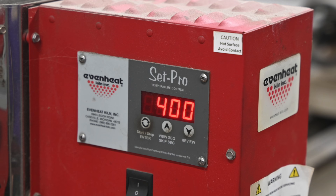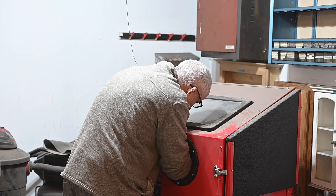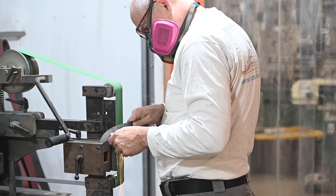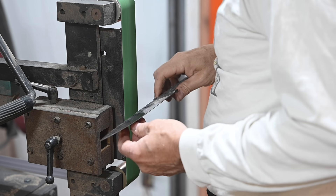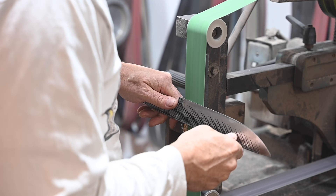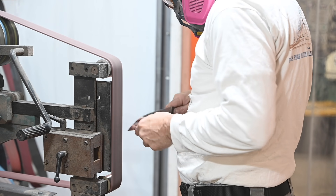After two two-hour tempering cycles at 400 Fahrenheit, I'm ready to grind the knife to its final shape. Before I do that, I'll use my abrasive blasting cab to blast off the scale and crud. You could also use a brass brush and a mild solvent like alcohol or even acetone, a plastic vegetable brush with hot water and soap, even a pressure washer — be creative. Once you clean it up, immediately oil it to keep it from rusting. Back to the grinder for the final grind — I'll start with 120 grit ceramic, then 160 micron 3M Trizac, and finish up with a surface conditioning belt, which will give a relatively smooth but not shiny finish.